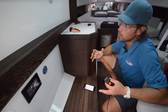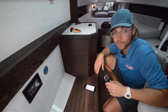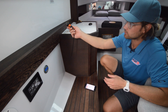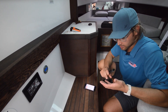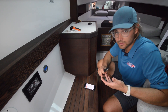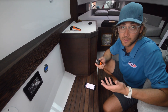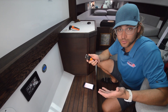We're here in this small forward cabin. We have the hatch wide open to purposely allow warm air to come in the cabin. With this anemometer, we're able to measure the velocity coming out of the duct. And with all these figures — supply air, return air, and the supply velocity and volume in CFMs — we're able to calculate the system capacity in BTUs per hour.